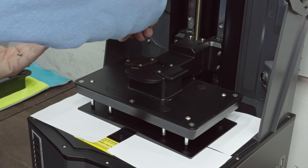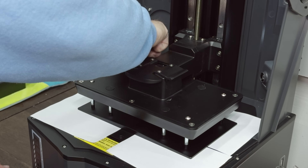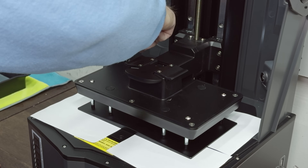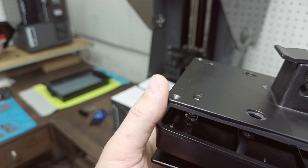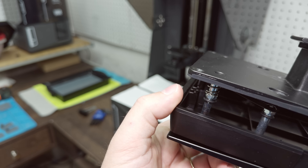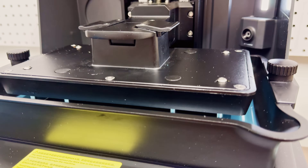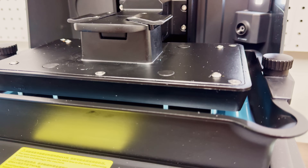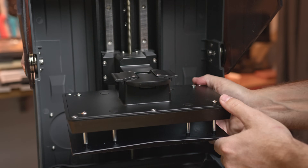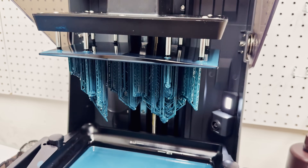At this point I tried manually leveling the plate, even though there aren't any real instructions for doing so. The on-screen guide vaguely walks you through the process but essentially leaves you with 'adjust the four leveling screws.' Problem is, that didn't do anything — all the leveling screws were fully torqued down, and loosening them didn't adjust the plate, it just removed the screw entirely. So I had to completely disassemble the upper portion of the plate to figure out what was going on. What I found was that the plastic cover was screwed on so tightly that it restricted any possible adjustment of the shock absorbers in those posts connecting the bottom of the build plate to the top. The so-called auto-leveling system works by driving the build plate into the bed with enough force to flex the shock absorbers until all four corners make contact with the screen. This isn't auto-leveling — it's a four-corner-dependent suspension system. While it technically does what it's designed to do, it comes with serious limitations, reducing both quality and precision. And let's not forget what a total pain it is to clean.